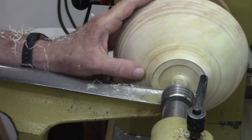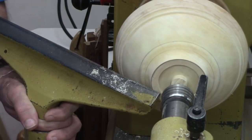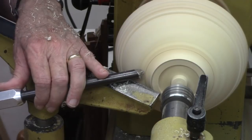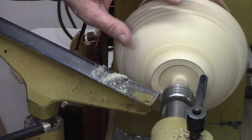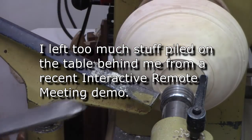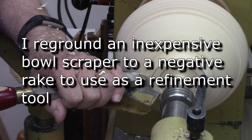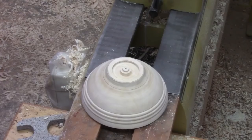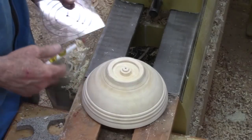All right, that looks good. Got just a little bit of a bump here in the middle — I need to probably shape that. I think the easiest way to get that is going to be with this round bowl gouge scraper and a half-round file. There are different ways to mark the feet. I'm using three feet because it'll always balance even when this dries and goes oval or becomes organic, just like a three-legged stool.